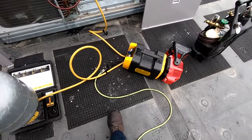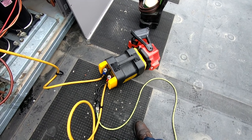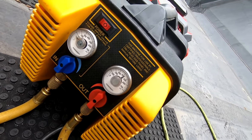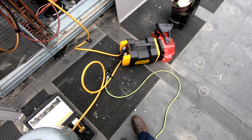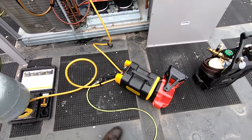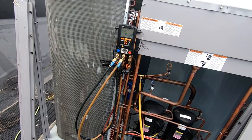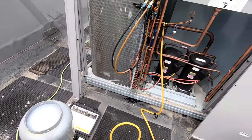Another trick is cramming more air through the machine — it actually doesn't do too bad of a job. I'm pulling straight off the circuit and just monitoring it with the gauges to see where I'm at. We're maintaining about 425 area, tripping at about 5 and a quarter, so this is actually working better than pulling the tank. If I had two of these fans it'd probably be even better. Today's about 80-82 degrees. We're right at 30 pounds, so we might be a pound or two off from the full charge — we'll let it go a little bit longer.